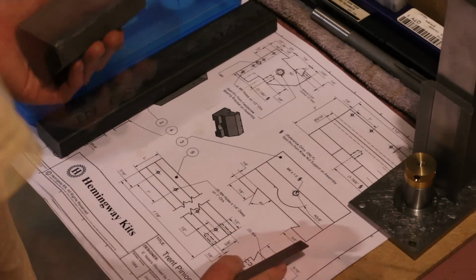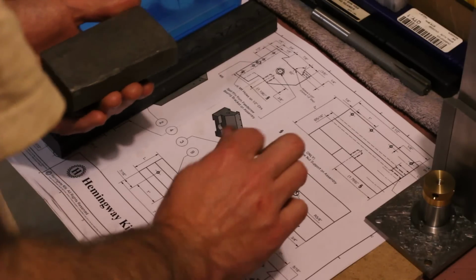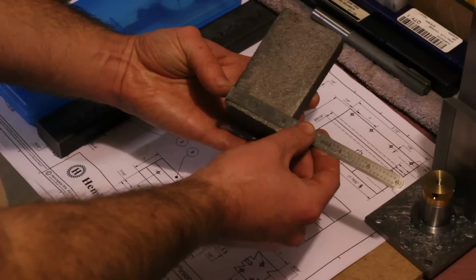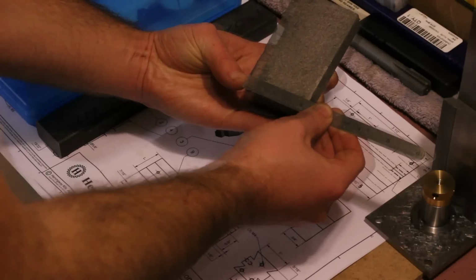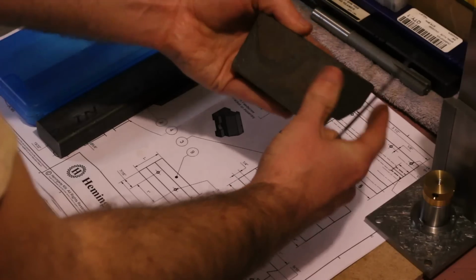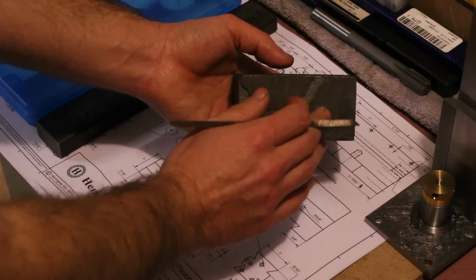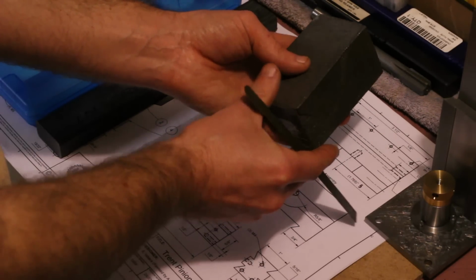So in this case, I'm looking at the dimensions of the top surface, and I know that we need this dimension to be about 2 inches by the time we're done. Again, none of these are super critical, and at the thinnest part of this section we've got just about 2 1/8 inches. But then if you look on this back surface, there are some low spots here, particularly around here. Where we're milling out most of this for dovetails anyways, most of this doesn't matter. But way on the outside end here, we do have a low spot that we need to consider.